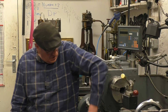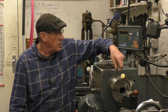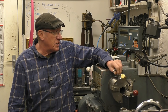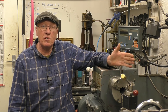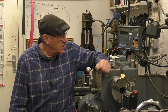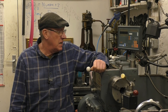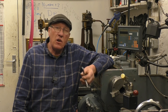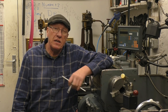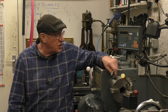The next safety item is the chuck key. The chuck key has one use: it's for tightening the chuck. You tighten the chuck up with it, then you take it out and put it down there — wherever it lives, mine just lives down there. It looks good, you can find it straight away. You never ever leave the chuck key in there. This lathe will accelerate from zero to two thousand RPM as quick as you can see that. If you set the lathe away with it in, it's going to fly out, and if you're lucky it'll embed itself in the wall behind you. If you're unlucky, it'll take half your face and embed that in the wall behind you. So you don't leave the chuck key in there, ever.